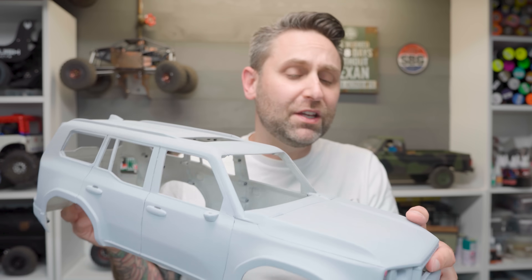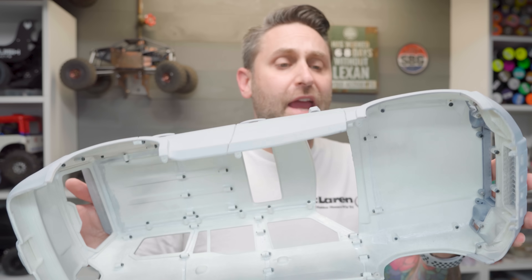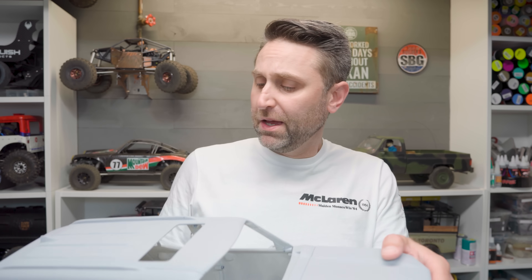But this is not typically going to be as strong as an injection molded body. It has to be put together with tiny screws and heavy solvents just to stay together. This is an ABS print, so it's certainly better than PLA — it won't deform as much under extreme temperature and is more resistant to UV — but it's not perfect. There are other stronger filaments: PETG, PLA Tough, or PLA-CF, which is a carbon fiber base filament, just like the PPA I'm talking about today. What they all tend to lack is the extra super-strong characteristics of metals or industrial-grade 3D printed materials.